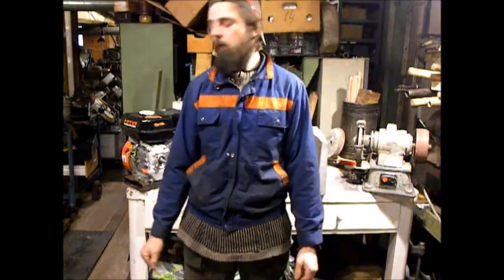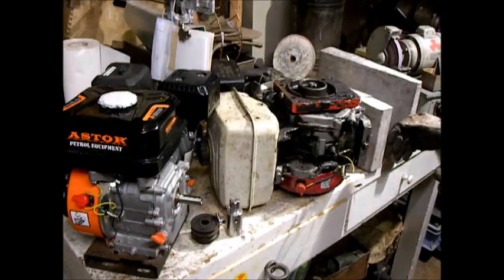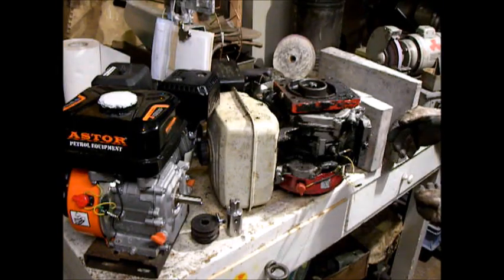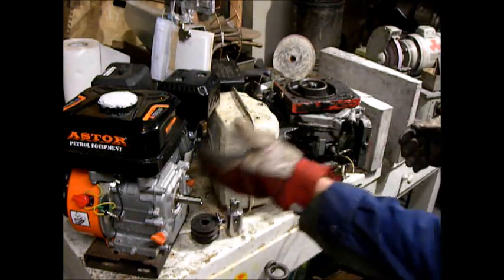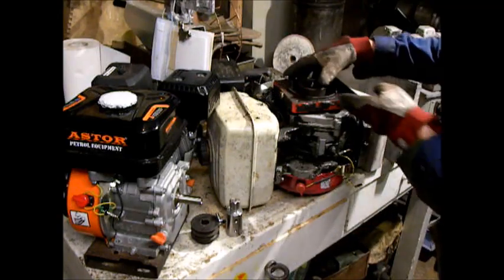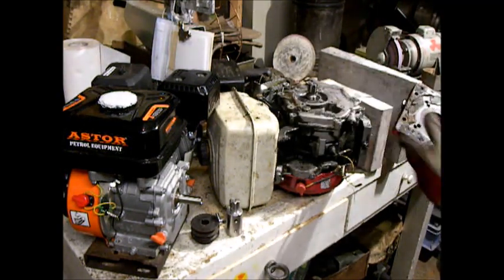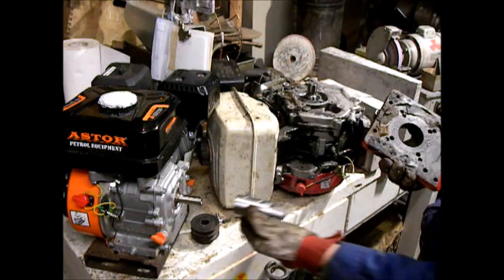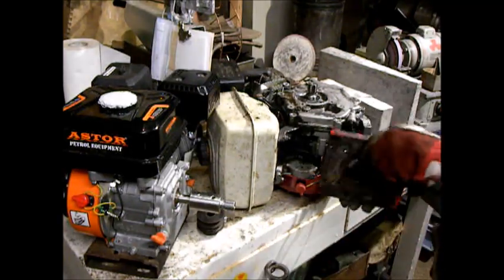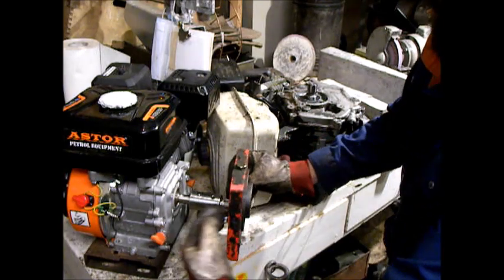Hello, welcome into my factory. I have a next job to do - let's take a look at it. A customer's tractor, or garden tractor, got a kaput engine. He brings the new engine and says he needs a custom adapter for it. This is the gearbox cover, this is the end of the crankshaft - I already made a part that fits right here, and I need to make a spacer in between this engine case and this cover.